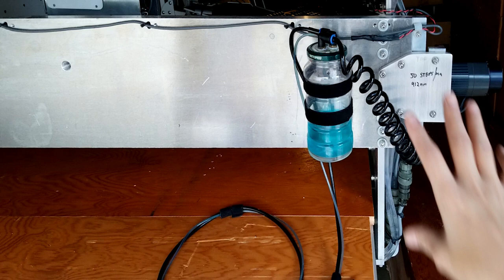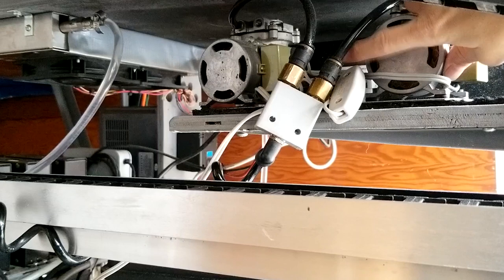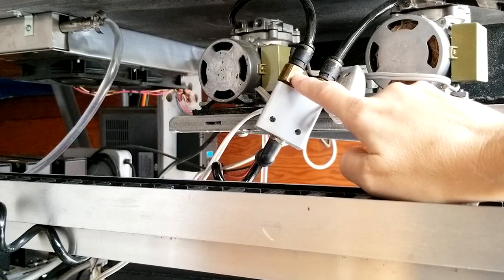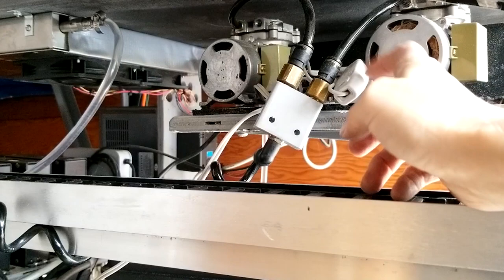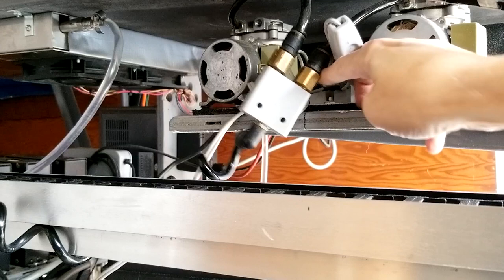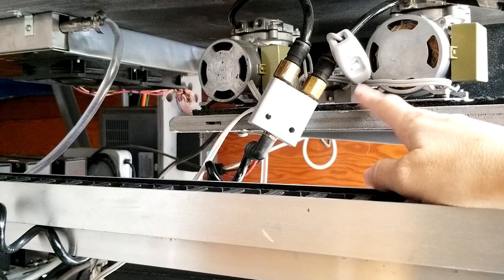Back here underneath the machine I've got two tiny air compressors — really vacuum pumps, but you can hook them up differently to use as air compressors, which is what I did. I used two hoses with two little fittings, and I 3D printed a little block to make a two-to-one manifold, then there's a little outlet with a switch to override it. Deep in there underneath is a digital relay that I happened to have laying around. This just barely puts enough pressure and flow to do the job, but it does do the job, and it's pretty quiet.